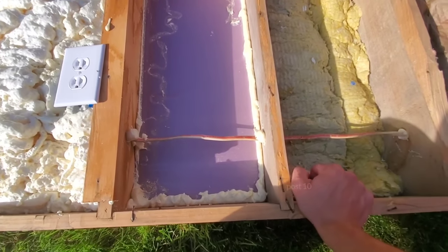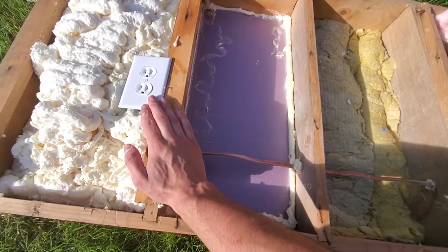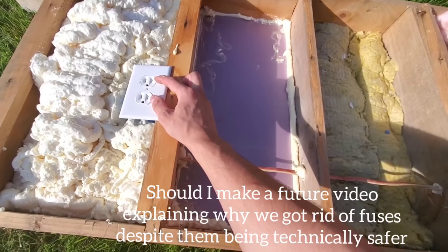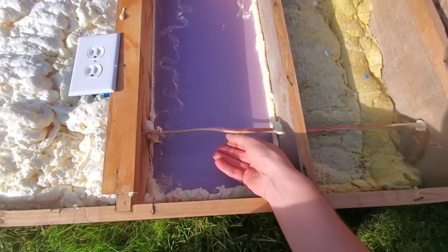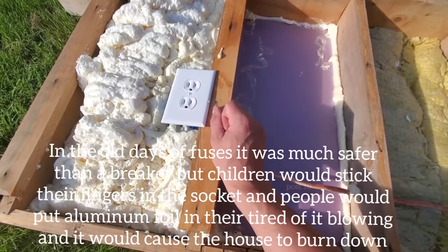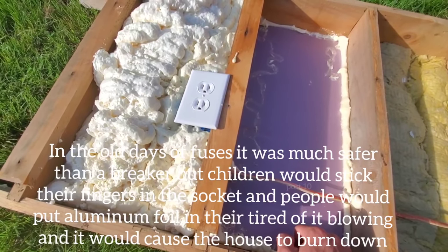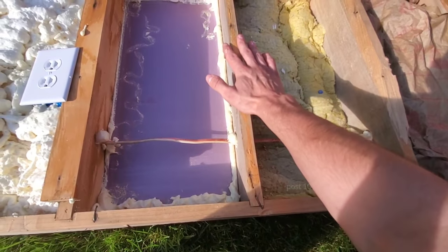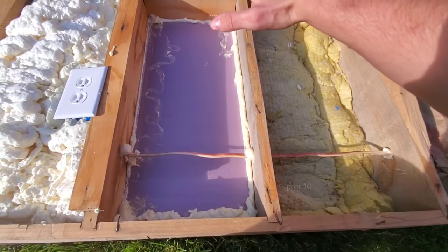In the real world, the biggest danger is this is 15-amp wire with a 15-amp plug. But you have a lot of people who will try to plug in a 20-amp air conditioning unit or a space heater — even two space heaters at the same time. A lot of times, before that breaker reacts, the line is going to start getting really hot. If you ever pull out the prongs and they're hot enough to burn your skin, that's a serious problem. That is more of an older building problem — someone plugs a space heater in and it causes a fire inside the wall. When covered with plaster or sheetrock, it wouldn't just go up in flames; it would smolder for a while generating more heat, then the entire outside of the wall would go poof.